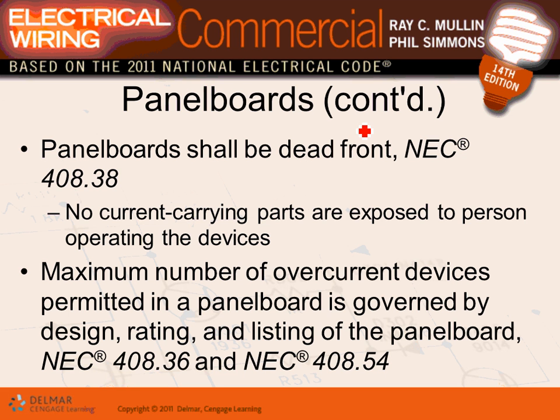Now you see, code book, guys: panels have to be dead front. What the heck is a dead front? If you hold this one, can you just touch anything energized here? That's a dead front. That's what they call a dead front right here. So nothing energized. All the panels have to be dead front. Otherwise, you open it and you're touching all these hot things and you electrocute yourself.